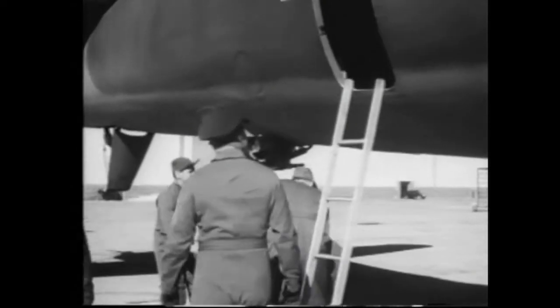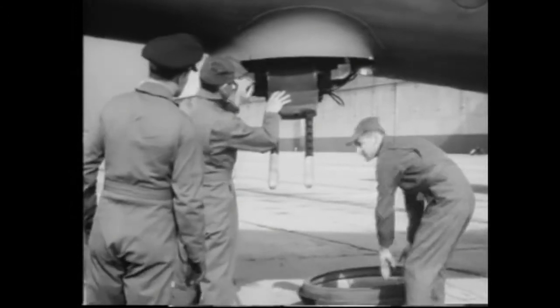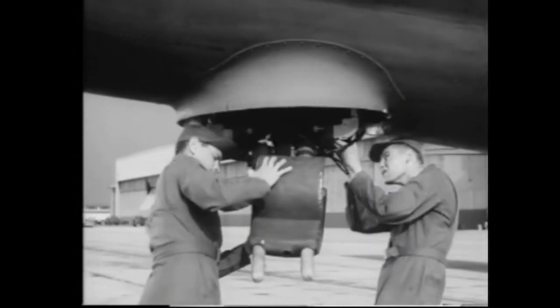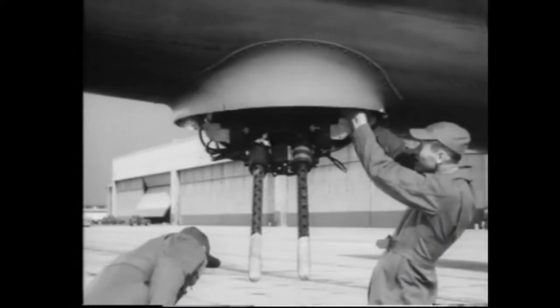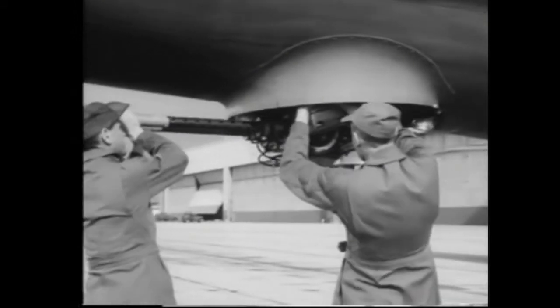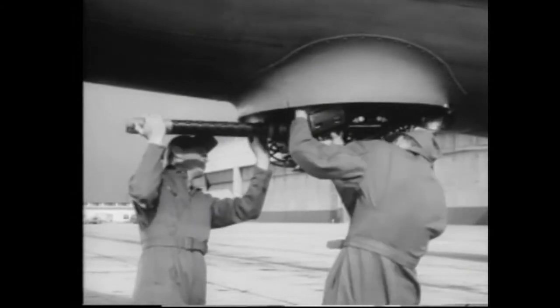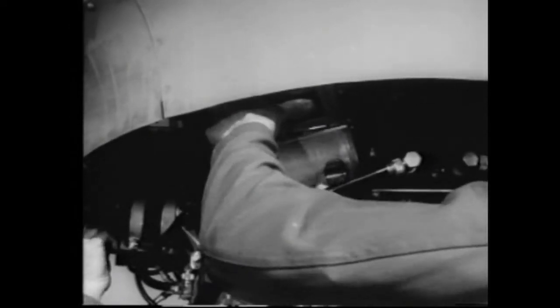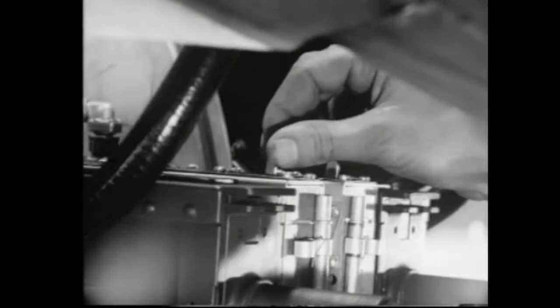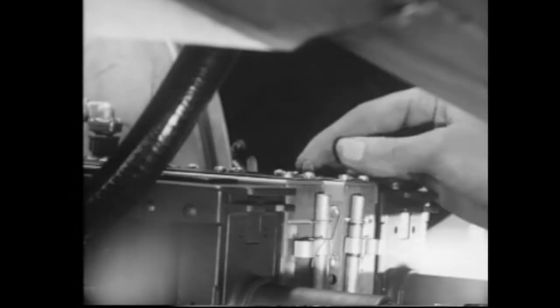But the pilot and co-pilot aren't the only crew members with inspections to make. The gunners, besides helping the pilot check the airplane, must also be sure the guns and gun cameras will work properly. They must inspect all five turrets in the same way they're now examining this lower rear turret. After they have the dome and gun cover removed, they see that the ammunition moves freely in the chutes and is correctly loaded. The guns just don't fire with the cartridges in backwards. They also check the safety wiring on the gun mounting bolts. Then the gun charging switches are put on reset — that conserves the CO2 pressure, which automatically charges the guns.